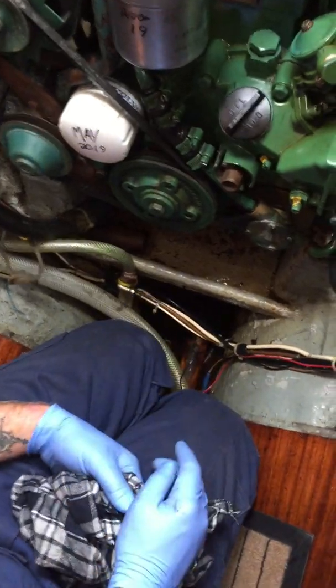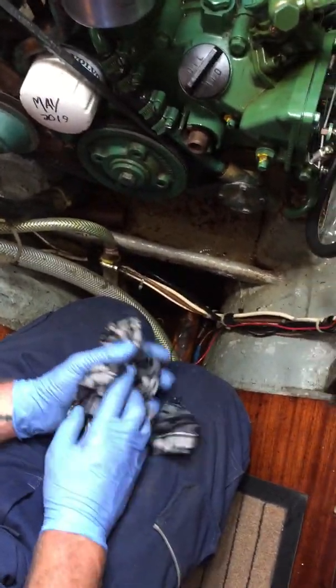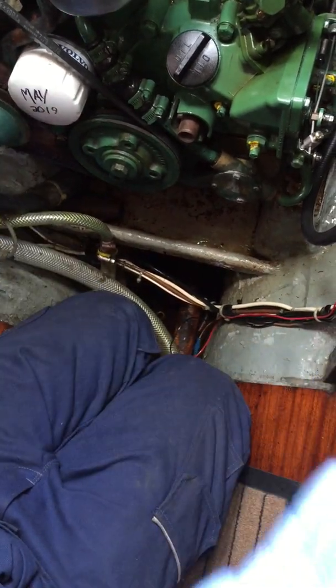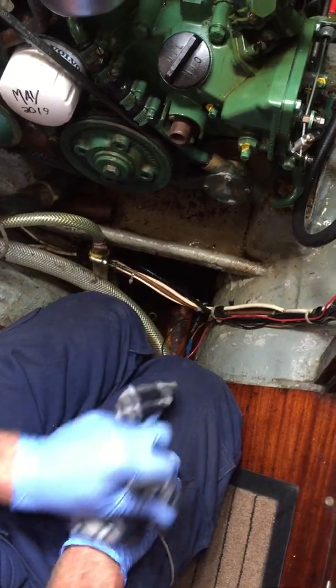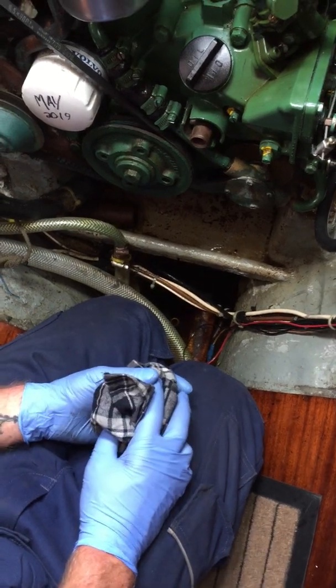Another reason you get water in there is condensation on the inside of the hull. We've had guys spending hundreds of pounds chasing water leaks for it to be nothing but condensation inside a hull collecting over time - which is obviously just the temperature differential, the summers and winters and the nights.